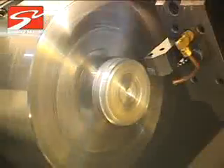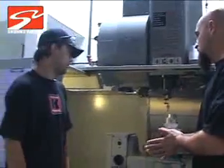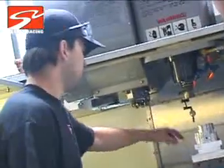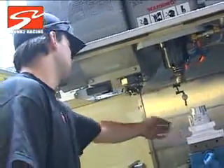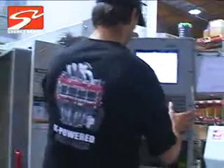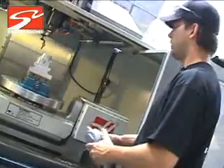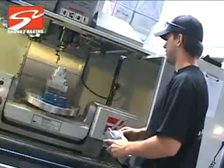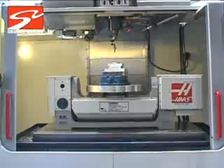What's the difference between this machine and that machine? That one's mainly for turning — just like a lathe, basically. So that's what we do the main amount of stuff, just to keep the bores real nice and true and concentric. This one does it from all different angles? What this machine will end up doing is all these holes down on the side for the throttle pulley and the bearings. And then along with the other side, I can actually go ahead and rotate this and show you what the five axis does. The reason they call it a five axis is because there are five axes. This would be your Y, and then you'd have Z, which is your up and down. Your X goes left to right, and then the fun ones are your A and B axis. This is your A axis, and this allows you to tilt and get into some really intricate parts with basic tooling.